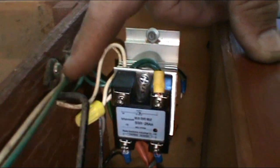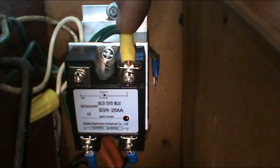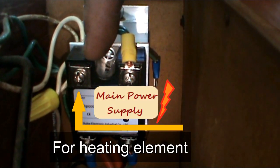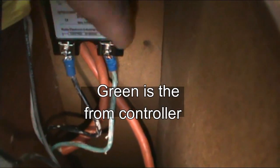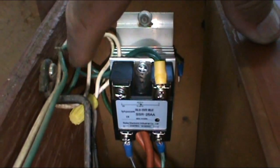What I've got so far is I have both of the heat elements attached right here. I've got to bring a main lead in here so that when this turns on, it'll activate it. The black and green on that one wire are the control wires. The white from that drop cord just goes here — it's the common for the fan and it's the common for the heater.